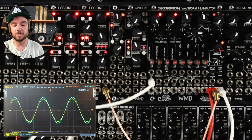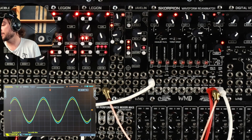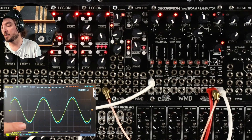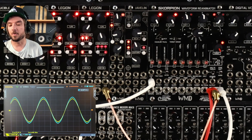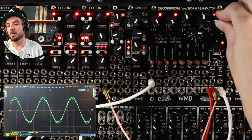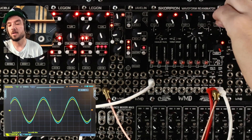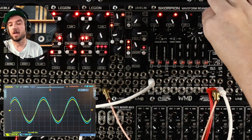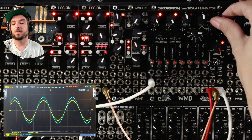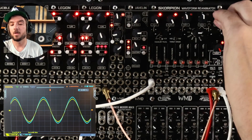This video is more of a get-you-started guide — just learn what you need to know before you start experimenting. I'm literally just running a sine wave into the input. We're taking stereo out into the mixer. On the scope, the blue line is the dry signal — the sine wave. The yellow is the wet signal from the Scorpion. Right now we've got just the dry signal. As we turn up the output at the top, we're going to go 100% wet. If we go all the way over, we go into a stereo widening function.